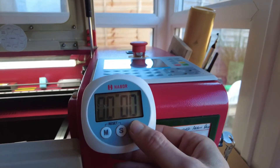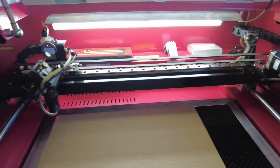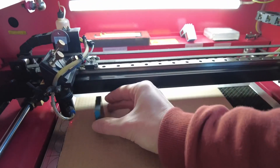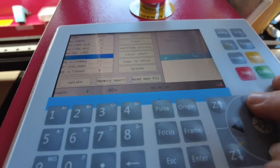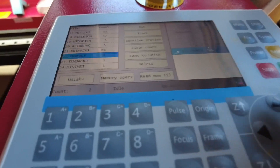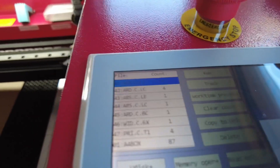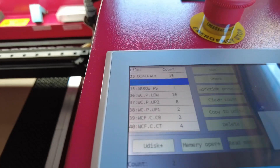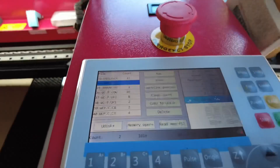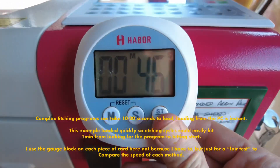Let's time it and see how we get on. So I'm hitting Arrow Packaging — put the material in, set the focal distance. This is an improvement I made the other week: I use a gauge block now instead of the ridiculous acrylic gauge the manufacturer gives you. So that's set. Then I go to the control and I've got to flick through to find the program — I've started using a naming format to help. Arrow Packaging — that's the one. Check the preview, that looks okay. Enter, it takes a second to load, close the lid, hit start. 46 seconds.